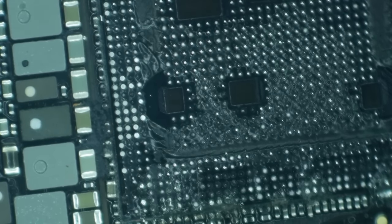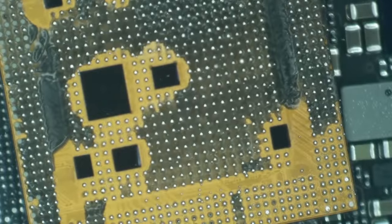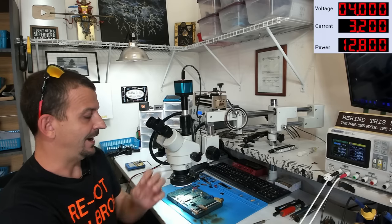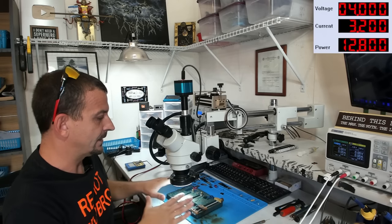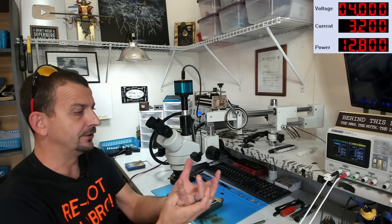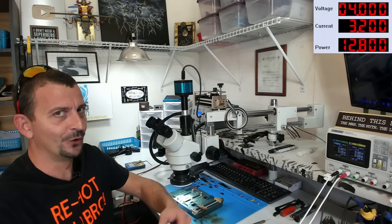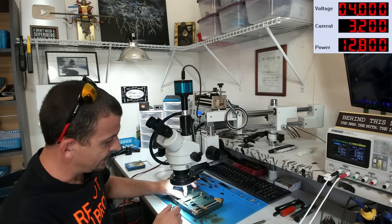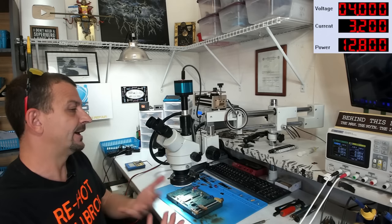Remove the heat. Now, at this point, I like to make sure that the CPU stays right here where everything's hot. To me, in my mind, these things are made out of glass, and I don't pick it up immediately and let it get exposed to the air out here, because right here we've got this ambient bubble of hotness around this CPU and it'll crack. It'll be like putting it in cold water or something. So I like to let it cool down a little bit slow, gradually working it away from the hot spot and letting it cool down slowly.